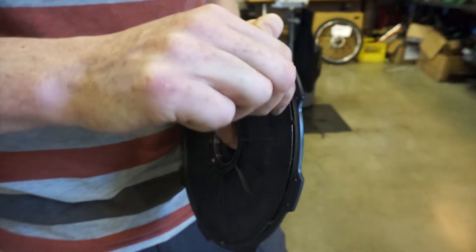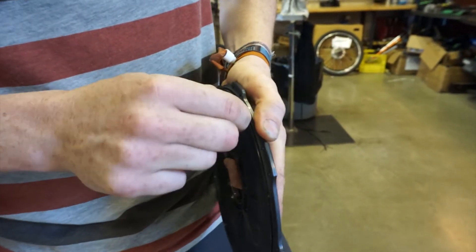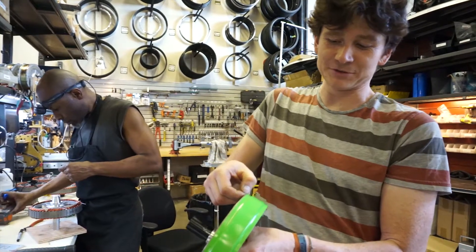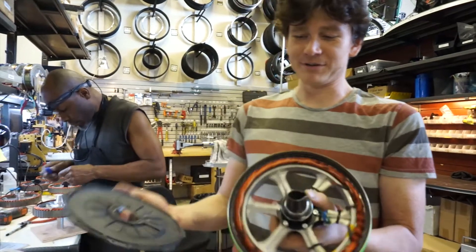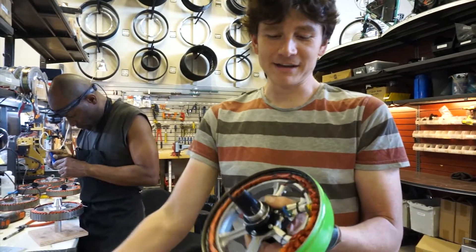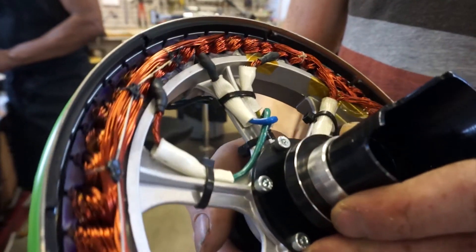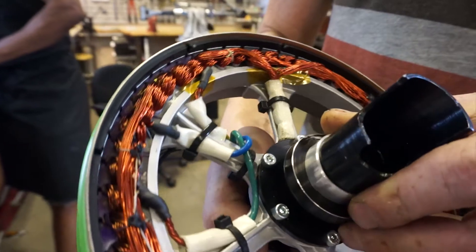I had to spend quite a bit of time cleaning out the gunky mix of epoxy and paint that filled up that groove, and now I'm going to have to sand and acetone-clean this down to bare metal and re-attempt the bonding of this ring so I can assemble the motor. Here you can see it with the completed customized axle — the extensions are now permanently affixed to the motor axle.